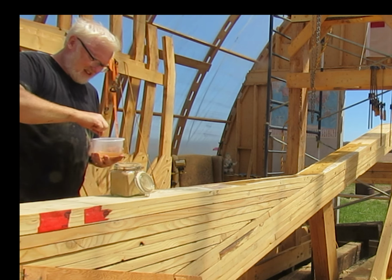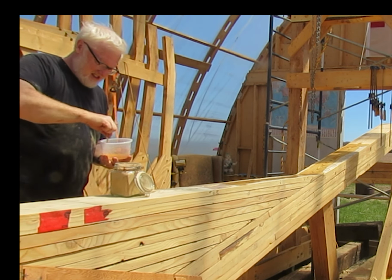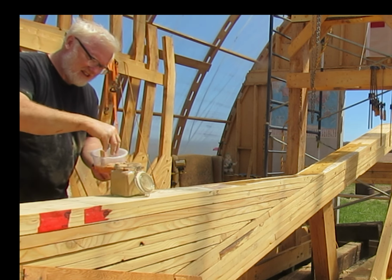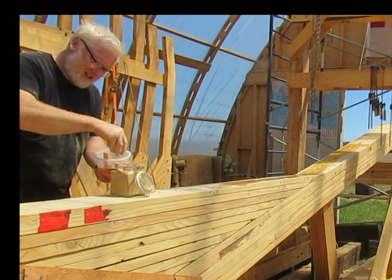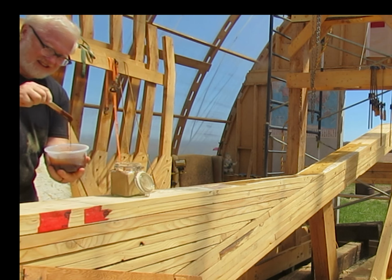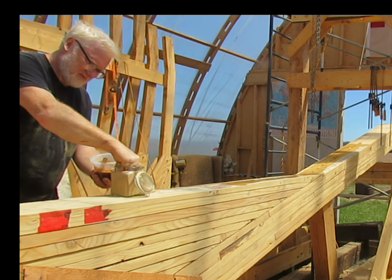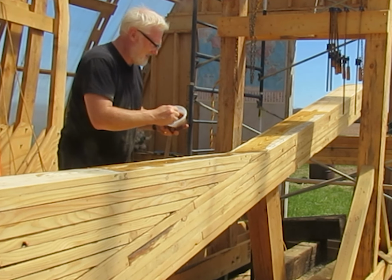With the wet layer on, a second layer of thickened epoxy was applied. I add fine wood flour collected from my orbital sander, adding it until a thick consistency is acquired. This thickened epoxy will fill in any imprints in the timbers and ensure a fully bonded joint.